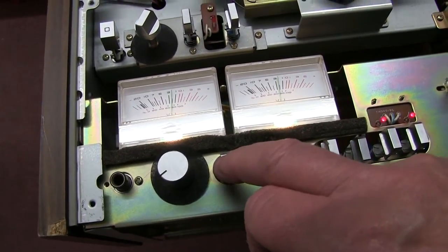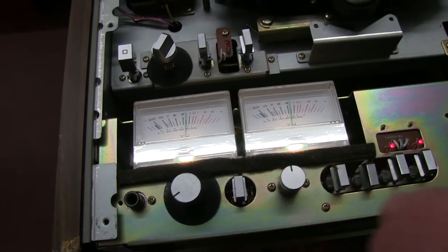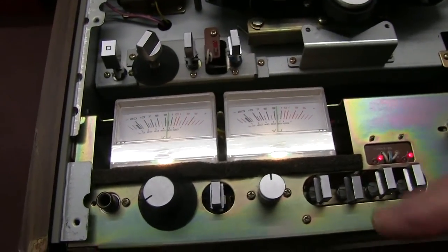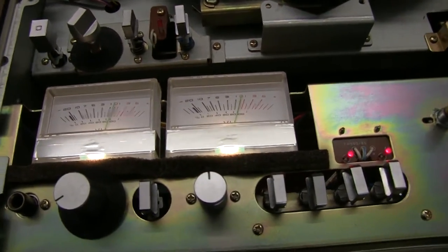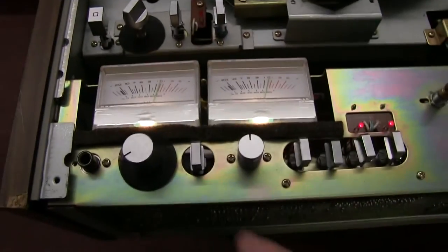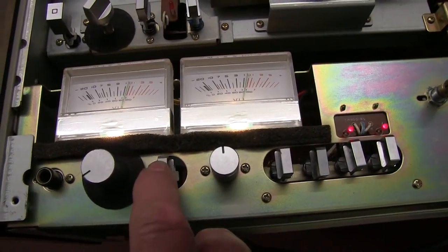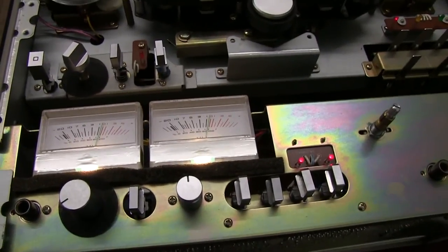There you go. 70 hertz. I think that's close enough. Not having to fiddle around, because the 1 kilohertz and the 15 kilohertz were spot on. Right, I've adjusted the 2 bias capacitors and got it near spot on, 0, 0. Oops, sorry. There's signal in, signal out, signal in, signal out. So that's pretty good. I'll just double check the other way.